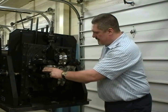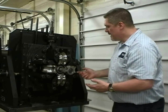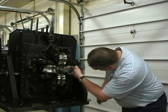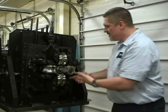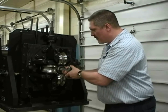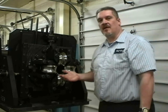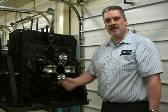Once that's been set, if the alignment and integrity of the rolls is good, this last side roll should come right in — adjust it in until you close out all the daylight and you can't see any daylight between the plug gauge and the roll. At that point, you should have equal drag on all the rolls. And if you were to go back and check with the feeler gauge, you should be very close to your gap settings, just as we achieved initially with the feeler gauge method.